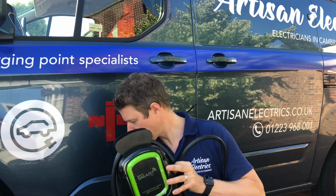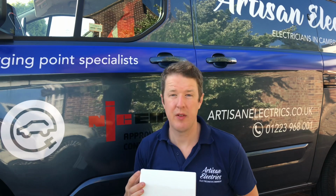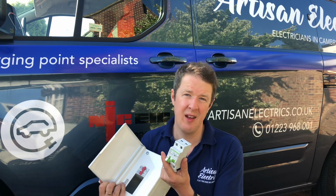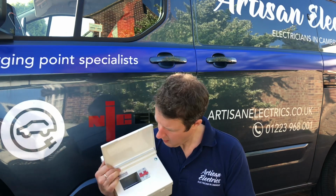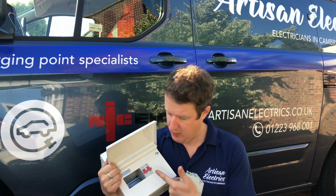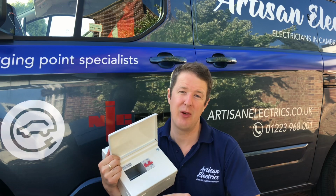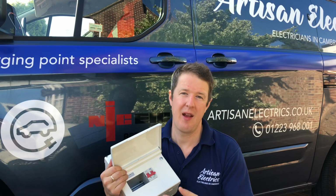kilowatt charger. And what I'm going to do is I'm going to install a separate little consumer unit next to the existing consumer unit, because it's just going to be easier that way than trying to fit a double pole RCBO in an existing Schneider consumer unit. So I've got this little 4-way garage board from BG with just a main switch, and what I'm going to do is put this double pole RCBO in there, put a Henley block in for the mains tails, then run some tails into this, and then I'm going to put a main earth block in.